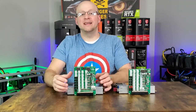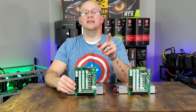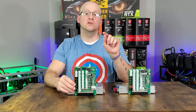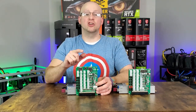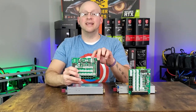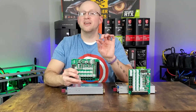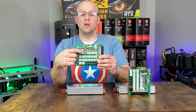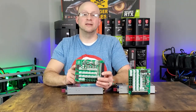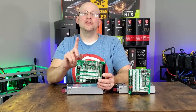Tips and tricks: this breakout board has a vast array of compatible server power supplies, but please check the power supply compatibility list on Parallel Miner's website to ensure you are using a compatible unit. Also, make sure you do not plug anything into the remote Molex section unless you are using a remote management module from Parallel Miner — users have reported back-feeding damage to the ZSX by improperly plugging into that section. Finally, make sure to plan out your build.